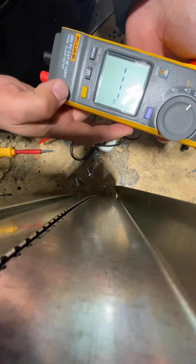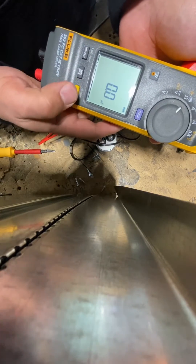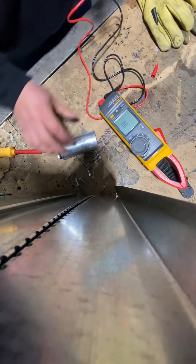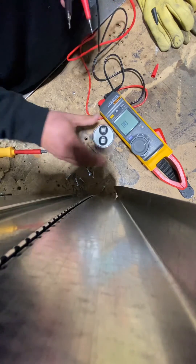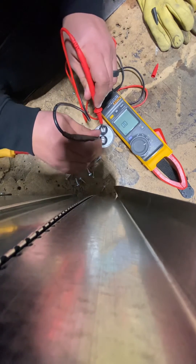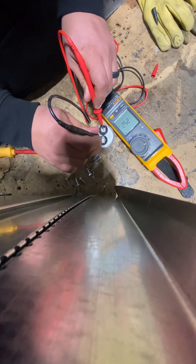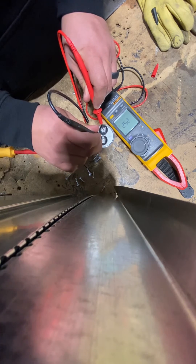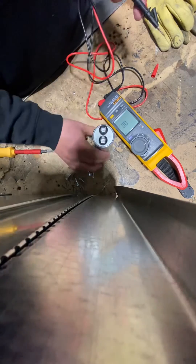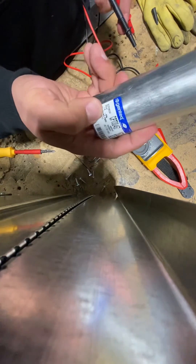Go to the ohms, press it — you're at microfarads. That's it so you guys can see it. Now we're going to check it right here. Give it a second, and this one's reading at 25.2, which I believe is right on the money.